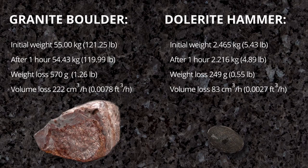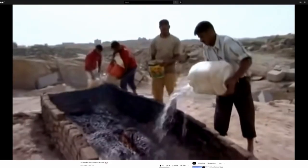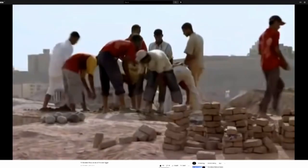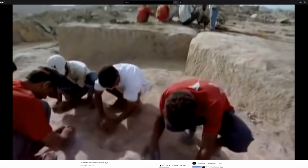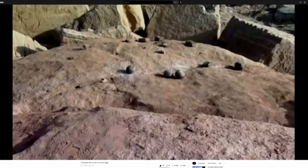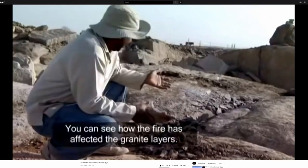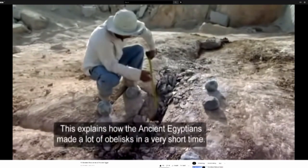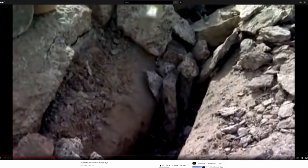They were also working for about half an hour. After half an hour, the control group using no fire had made little impact on the fracture line. But at the burnt fracture the crack was crumbling. You can see how fire setting affected the granite layers — it's working very very fast, more than expected. That explains how the ancient Egyptians made so many obelisks in such short times.